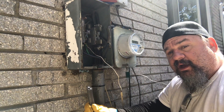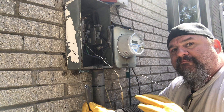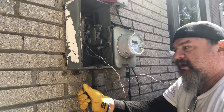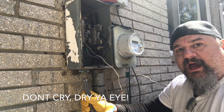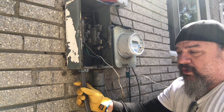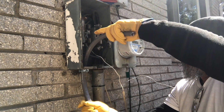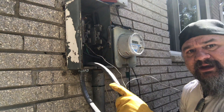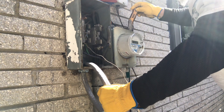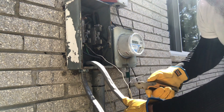I try to do a channel to help the homeowner, the beginner - just to show you some things. You'd be amazed at the YouTube police. Anyway, remember this is hot that I'm working with, so I pull it out and guide it out with my hand. Now I know I'm going to need about four to six inches, maybe more of cable, so I pull out a little too much and figure out right around where it will be good.